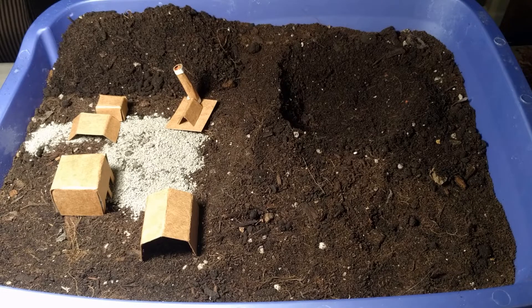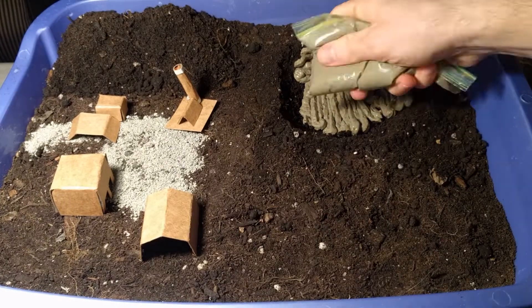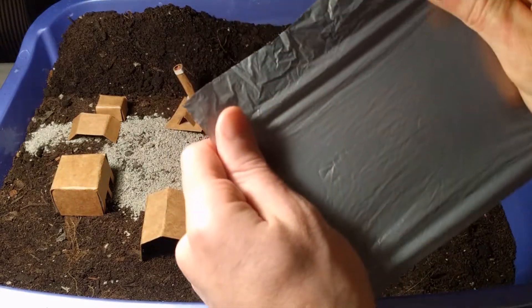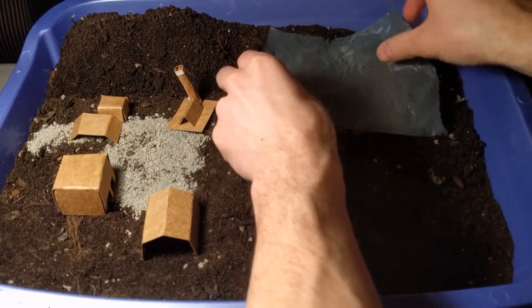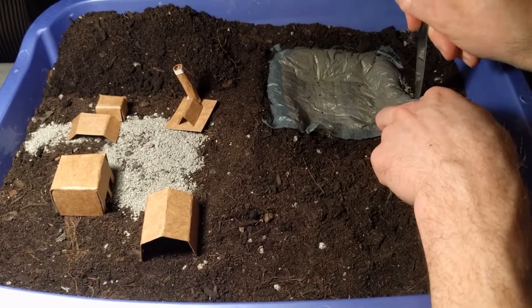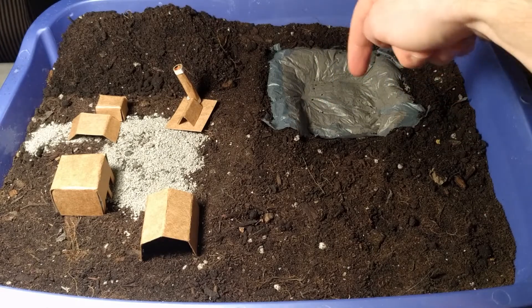The first thing we'll need to put in is our liner system. I'm going to construct a liner that follows one of the designs in Ontario Regulation 232-98, which uses compacted clay with an HDPE liner on top of it. So I'm going to pipe in some clay. I've constructed my compacted clay liner on the bottom and on the sides — I have one side open so that I can expand in the next stage. Now I'm going to put in my HDPE liner. This is actually a piece of shopping bag, which is also HDPE; liners are a few dozen times thicker than this but it's the same material. This goes on top of our clay, and the top edge is secured with an anchor trench. Together, this plastic HDPE liner and the clay underneath it are going to stop or at least slow down the leachate from penetrating into the groundwater.